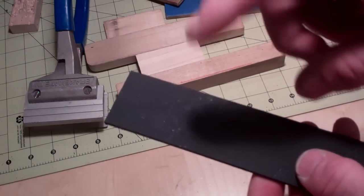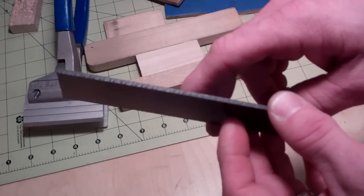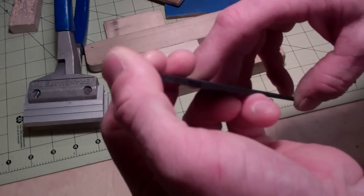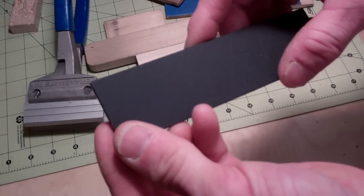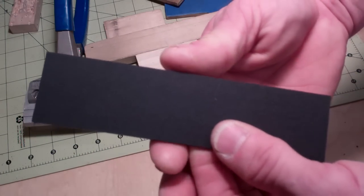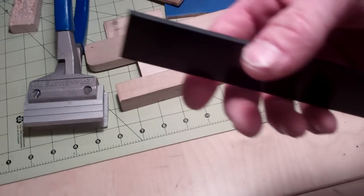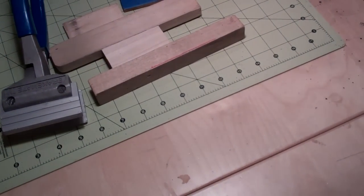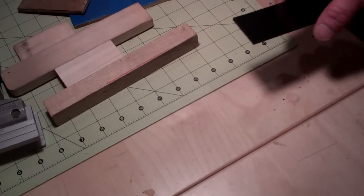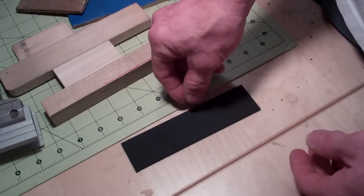I start with some 1/8 inch Kydex, which is basically .125, 1/8 of an inch thick. I get all my stuff over at knifekits.com. They have great turnaround time and are really helpful. I take it and cut the strips to be about 1.5 inches wide on my bandsaw, and that's where we all start. Bear with me here. I'm going to go step by step, so if you do want to duplicate this, you can see what it's like, and I'll let you know some of the stuff that you're going to need.